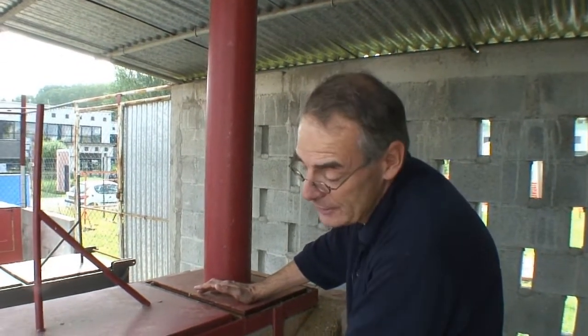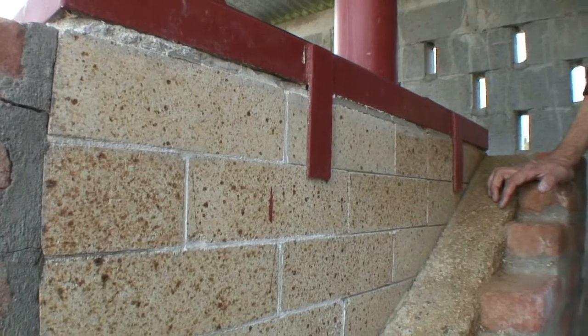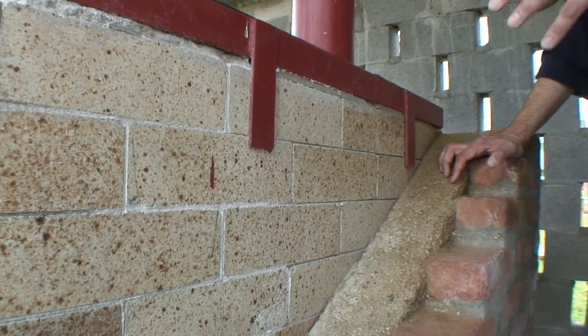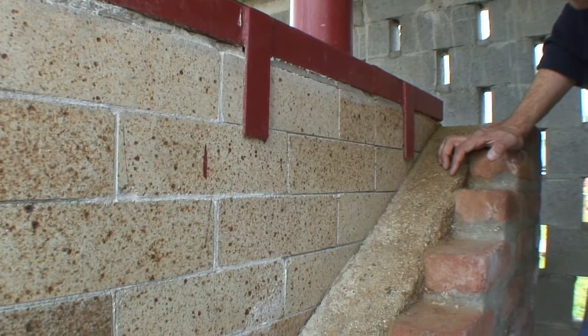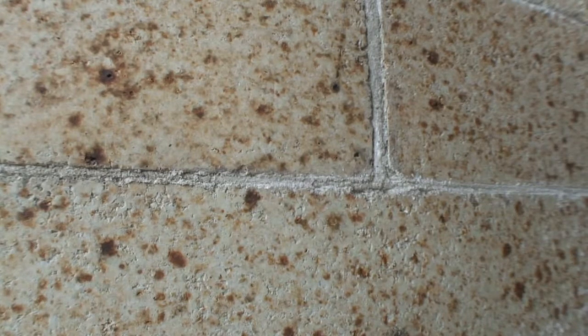How can you recognize a good brick? Well, it's not so easy. The bricks we are using are mainly aluminum oxide — Al2O3 — with a composition of about 60% of that material. You want to have as low an iron concentration as possible, but always ask your supplier about the composition. The bricks are very dense and heavy — every brick here is about 4.5 kilograms a piece. Dense also means very hard.